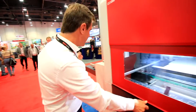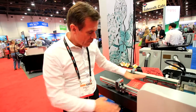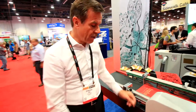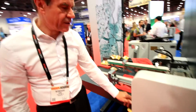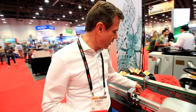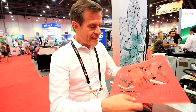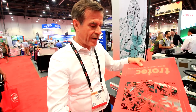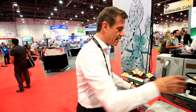I'll close the door and we go to the unloading station. Same capacity as the loading station. We have sensors that move the table down as more paper is unloaded — I'll just do that manually here. Normally it's done automatically by itself. We make sure that the paper coming out will be unloaded flat so it doesn't collapse on itself or interact with other papers — it just moves out and unloads flat to the unloading station.